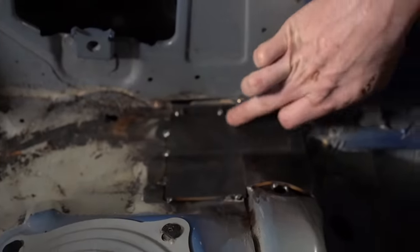The only thing with 1.75 is it's a little more difficult to run because the centerline bend radius is larger, making it harder to fit in newer chassis that have a lot of curves and tight corners. Either way, we're gonna go with 1.75 because it's the better option structurally, even though it requires a little more effort on our end for the design. I also have the 350Z fully designed with 1.5, and I don't for 1.75, so it's going to be a lot more work for me.